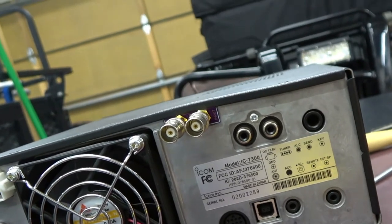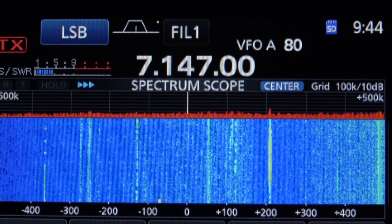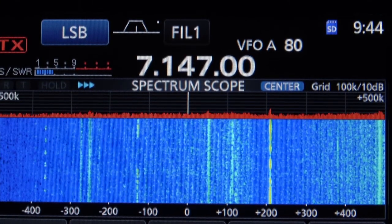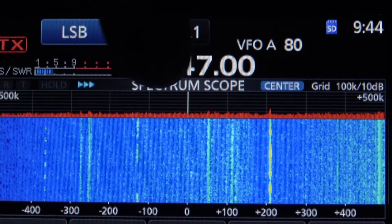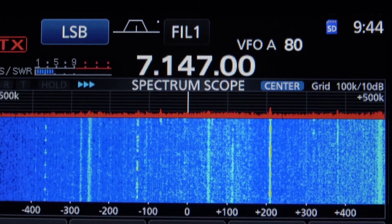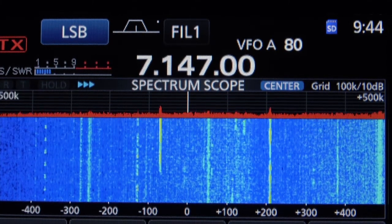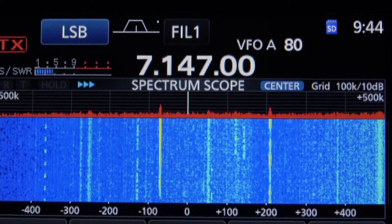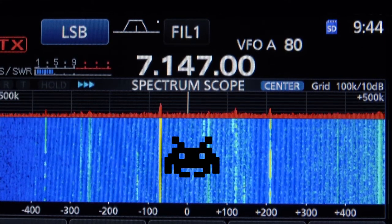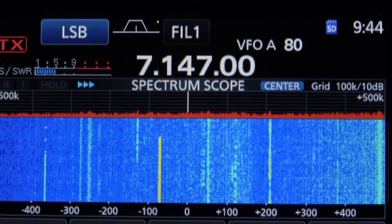There's a little bit of a hump from this adapter — I have it seated in there properly, it's just a skosh too big, not a big deal. Testing on 40 meters — this is with the unit off. I discovered after a lot of testing with the knobs, phasing, and antenna gain that reducing the main antenna gain is counterproductive to pulling out weak signals. Most adjustments are with the auxiliary antenna and the phase adjustment.